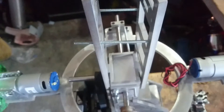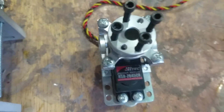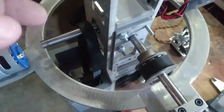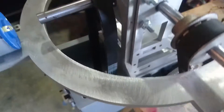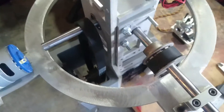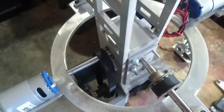And then we have the head part. There is a servo here — it's a constant rotational servo. That'll be mounted up here. And when this pulls, it'll pull this whole thing either left or right to make the head move. So if I want to do a 360 rotation, I'll have to move both of these in unison to get the head to move completely around.